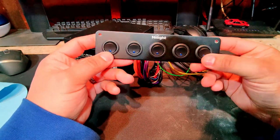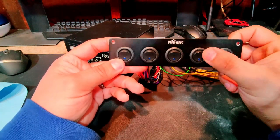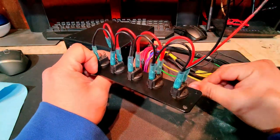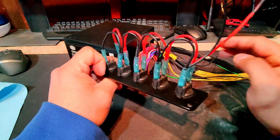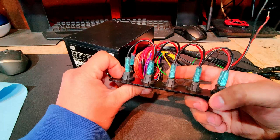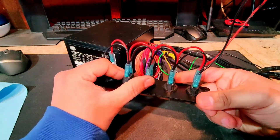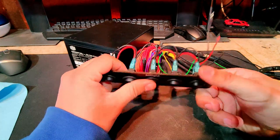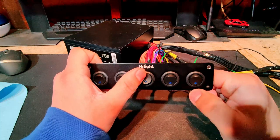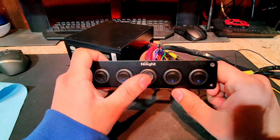And it's worth mentioning because I believe two out of my three switches will not have that light on, because I just need the ground wire and this green wire coming into the power supply, and then the blue for the amplifier. The radio one will most likely work because it's going to be 12 volts, you know, going in and out, and then as long as I have this ground wired up properly, the little light will work, which is good for me because odds are I'm going to have the power supply running on at all times, so I can have all my settings saved.